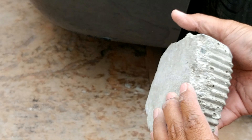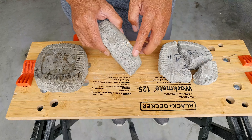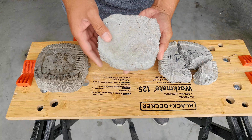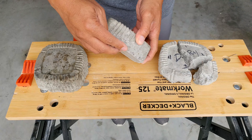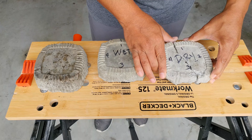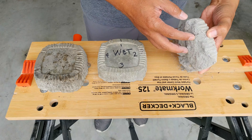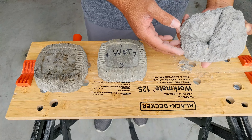This is still the wet pour. Let's check both samples and talk about the conclusion. This is the sample for the wet pour — you can see a lot of damage happened to the side, which is expected because that is the weakest part of the concrete. This is the dry pour sample that's left. During the beginning of our testing, we saw that the sides of the dry pour received more damage compared to the wet pour, but the overall strength was there until the third set of the second round where it finally broke in the middle.